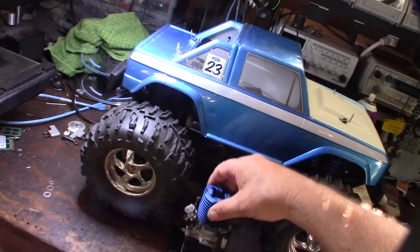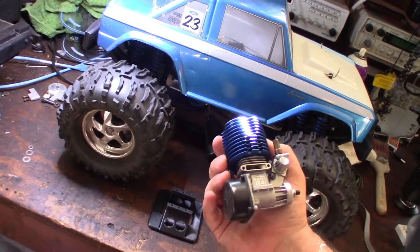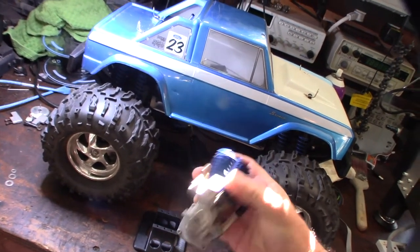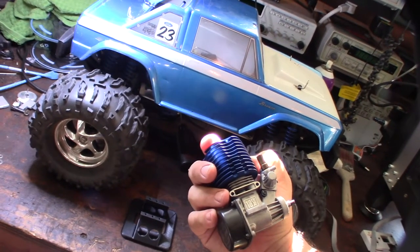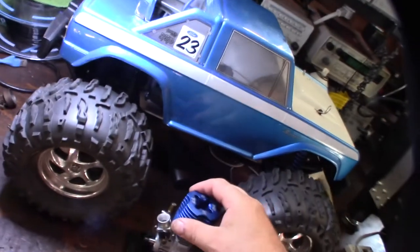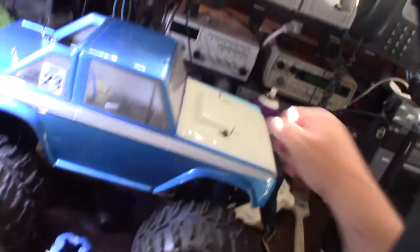This is the engine that's going into it. This is actually the most high-end side exhaust carb you could get for the era — it's an OS-18 CVR. In my previous video there had been a lot of modification work: mod work on the crank, carburetor's been opened up. I didn't do that, the previous person had done that. Compression feels good, still a good pinch left.